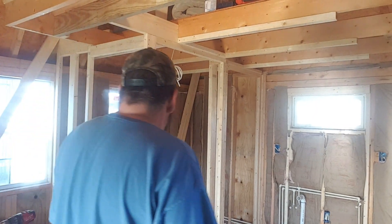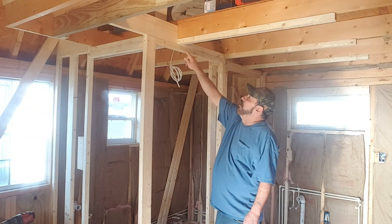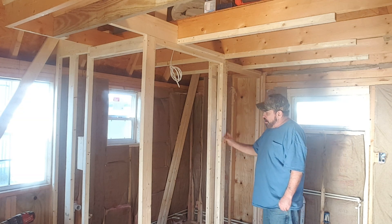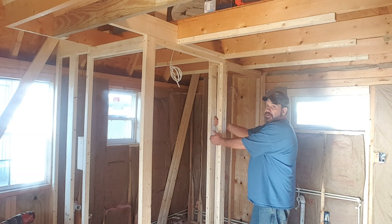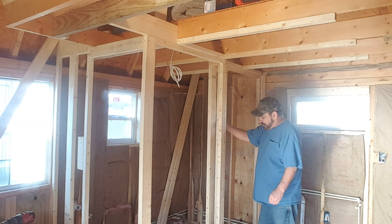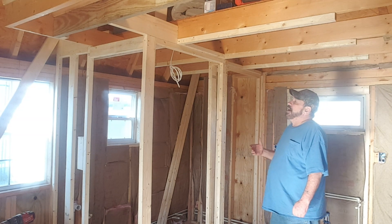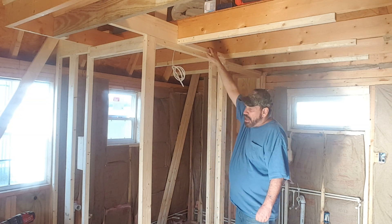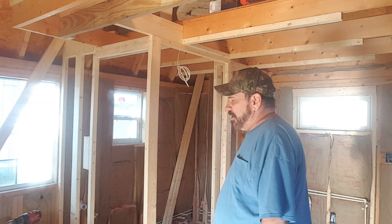There's the basis of my wall. I went ahead and added braces up here to be able to screw to — they're screwed from the ends. We've got a corner here to nail to, an inside corner to nail to. This is a full 2x4 turned sideways, and this one's also a full 2x4 turned sideways. Everything seems to be measuring right and perfectly level. I've got to drill a hole through here to bring my wire down through.